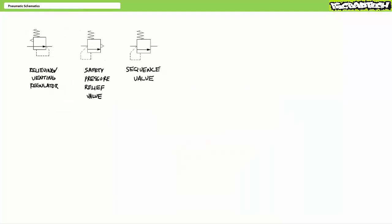One may also encounter pressure control valves in pneumatic systems like regulators, relief valves, and sequence valves. A regulator is a normally open valve with a pilot passage sensing pressure on its output. If it includes a venting or relieving passage back to atmosphere, it'll include an exhaust port. You may also see a normally open passage inside a relieving regulator illustrated using a bidirectional arrow.